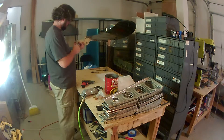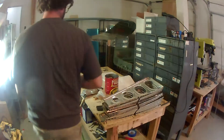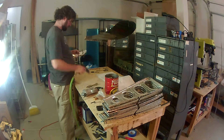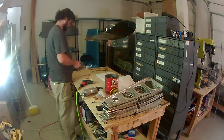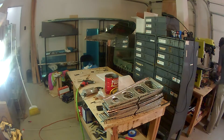You'll see that large stack of ribs, and then in a moment you'll see me trying to attach the actuator bracket into the number one rib — and it just won't fit. That's when I realized I didn't pull all the right ribs. I made the assumption that the right wing would use all ribs labeled 'R,' and that's simply not the case. So make sure when starting this chapter that you look at the diagrams in the front that show all the actual parts and pull the correct ones.